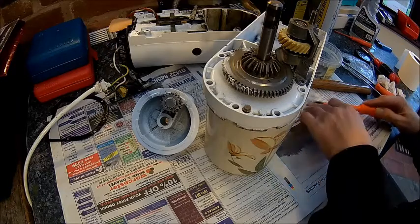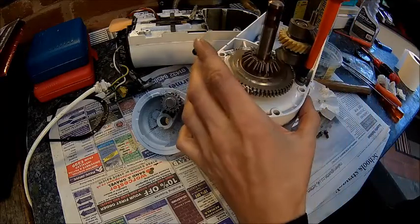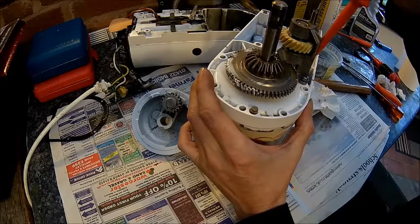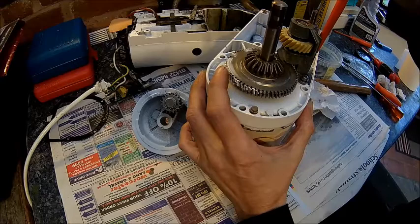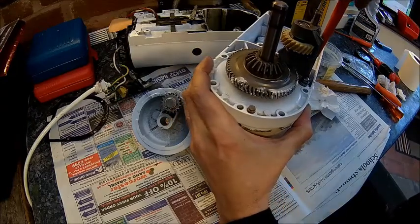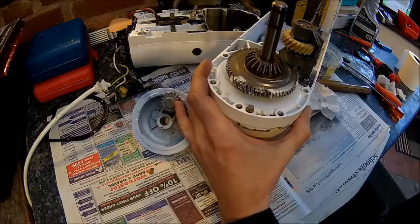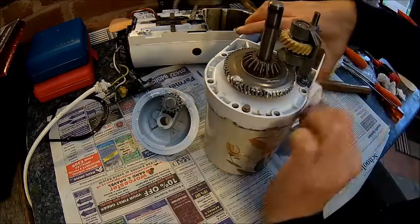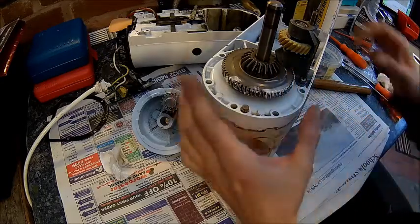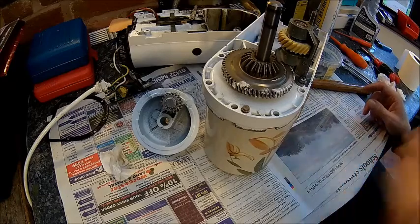So now we need to get the bolts — the bolts are all imperial, so if you lose one, just remember it's not metric. Before you tighten it up, set the three bolts gently and then make sure everything turns nice and freely, which it does. Then just tighten them up. They've got lock washers underneath — make sure you have them, because if a bolt comes out and ends up in the gear, you've got a problem. So this turns nice and freely — that means this part is now assembled.